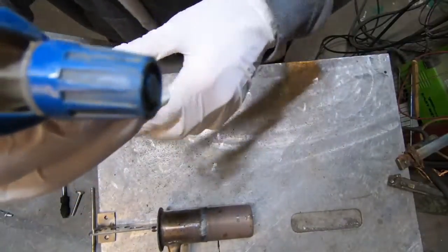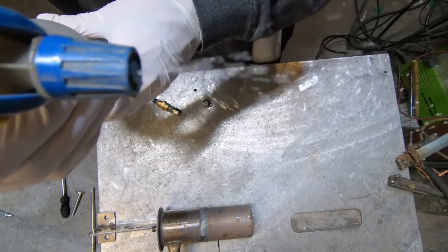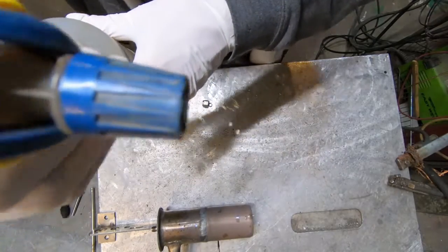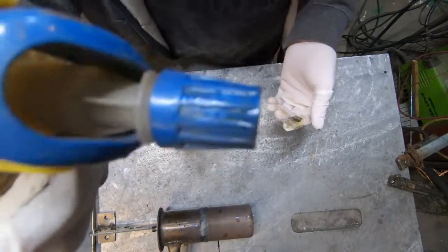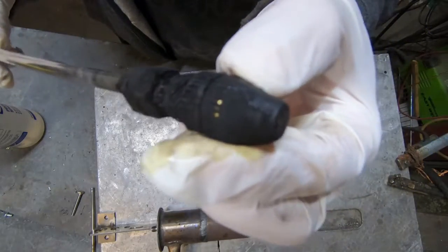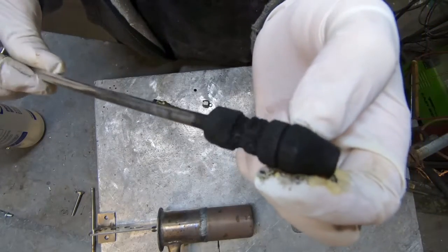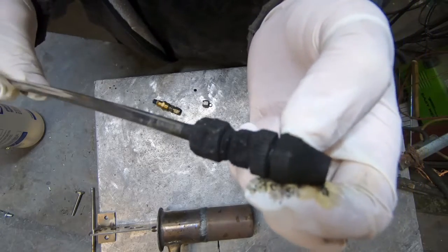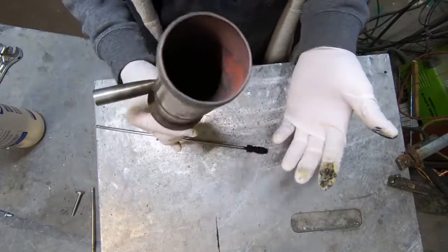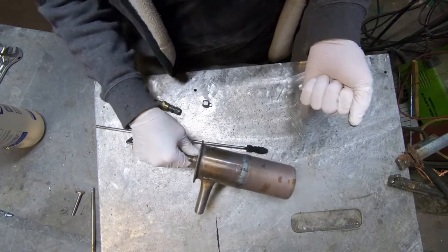Here's the nozzle. If I give it a good hit it's atomizing, but if we reduce the flow rate — we haven't done anything to the nozzle, all we did was adjust the flow rate — look at that. So that's one of the problems with these atomizer type burners: the fuel atomization cannot be adjusted on the fly unless you adjust this particular constituent. You've got to adjust the flow rate and the nozzle position, so the fuel would require two adjustments alone, and there's the air on top of that.